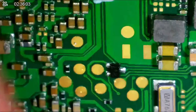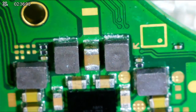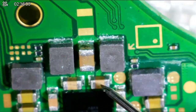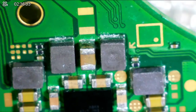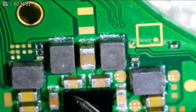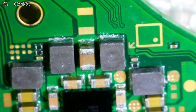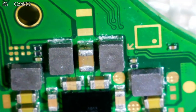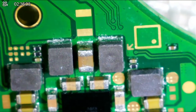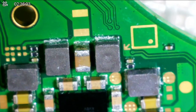It's strange. But it definitely seems like this inductor pair here and this inductor and then this set of capacitors is the dual power core for the system on a chip. And it's going to be low impedance because if it's a 0.9 volt power rail, then 40 ohms resistance to ground is going to be normal, and that's going to be fine. But if it's a 1V8 line or a 3.3 volt line, then that's too low. But it looks like it's going to be low power.